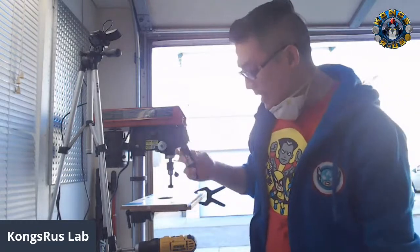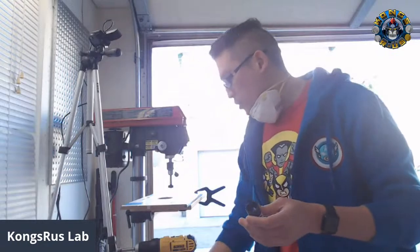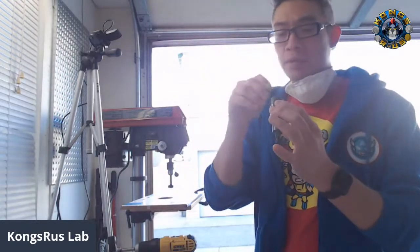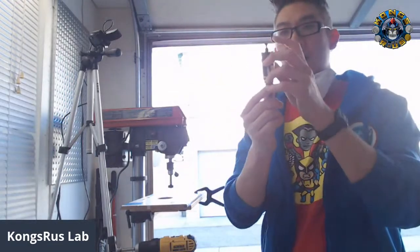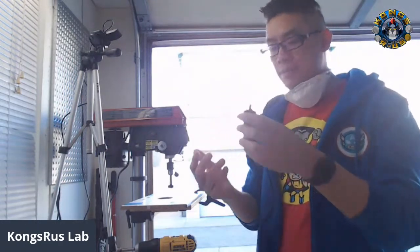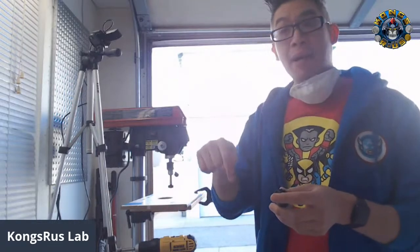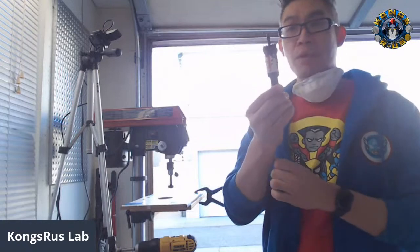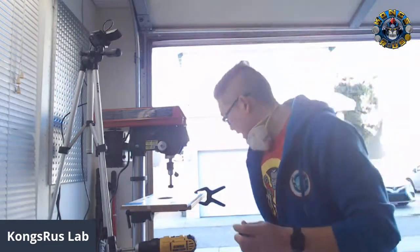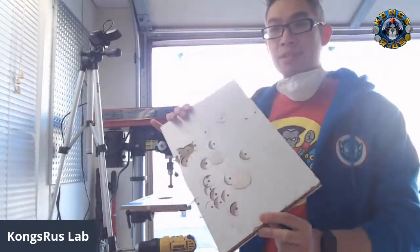And then normally, and I actually removed it, there's an arbor in the hole saw as well. Depending on the ones that you get, there's an arbor, which is just a small drill bit in the middle, and this helps align where you're drilling. Sometimes you can take a regular drill or this one and make a pilot hole into your board and your plexi before you go, and this will help you get lined up exactly.